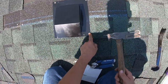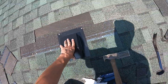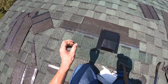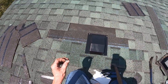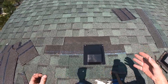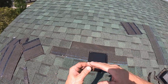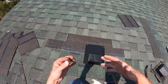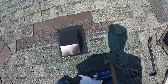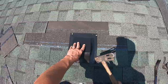Don't ever nail right on the outer edge or the very bottom — bring it up and in a little bit. A nail exposed will dry off relatively quickly and last a lot longer than you might think. As opposed to a shingle on it with moisture trapped there — it stays wet a lot longer and will rust out sooner. Pick your poison: possible wind-driven rain, or a nail rusting out over a long period of time.